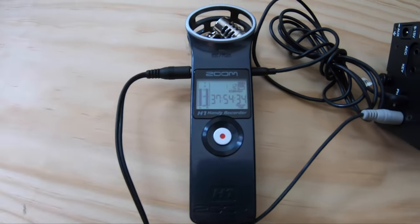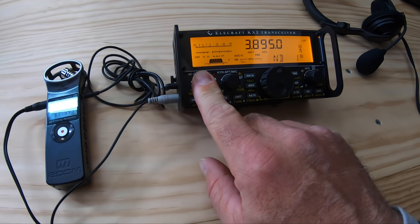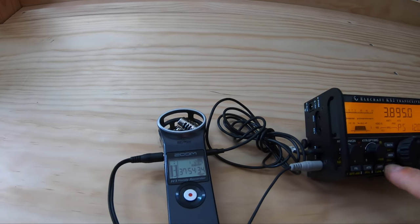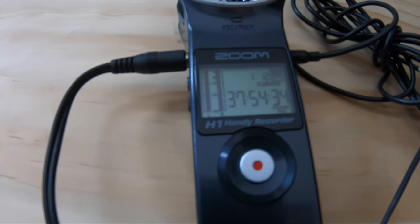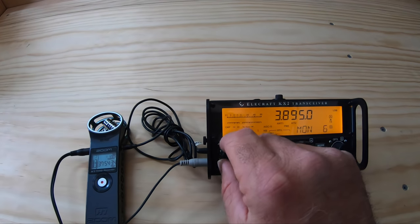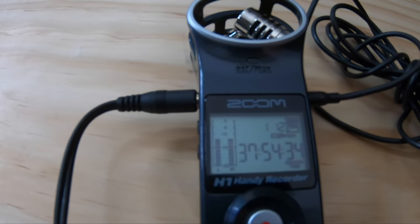So I'm trying to watch this meter while I'm recording my video. The other side of this is ensuring that when I speak into it, it's not too loud. So I hit the monitor thing — the monitor's at 20 right now. I'm gonna hit transmit — we got no power going out — KG6HQD, KG6HQD. You can see it's peaking out, it's blowing out right now. You can even see the red light flashing saying recording peak. It's warning me because the monitor is at 20. I know if I bring that monitor all the way down to about one or two — at one, look at where it's at when I'm speaking — I'm not quite up to the 12. I'm peaking at 12 now.